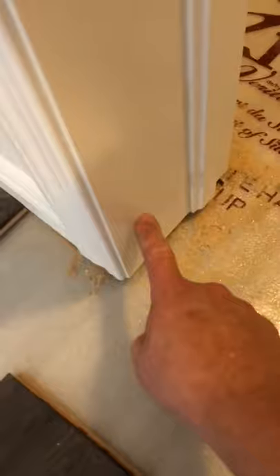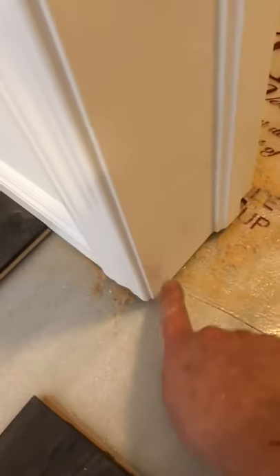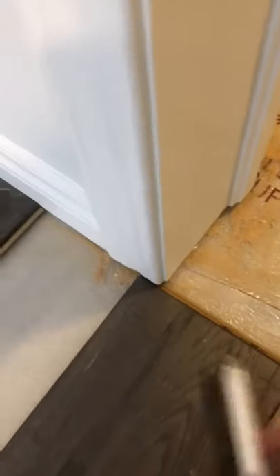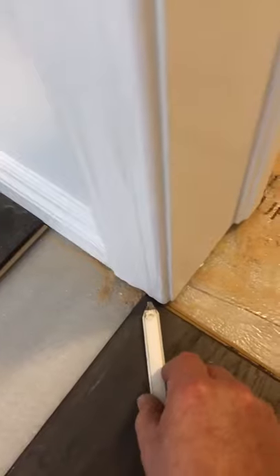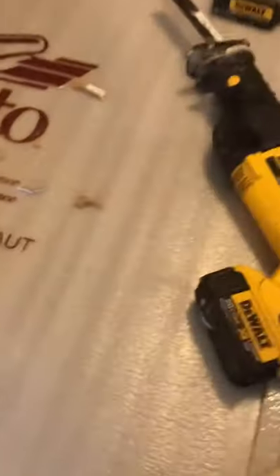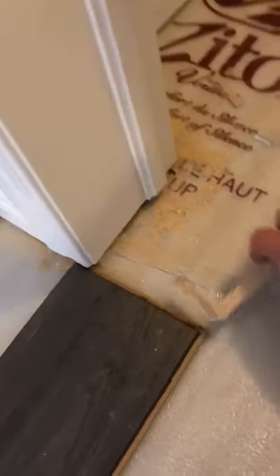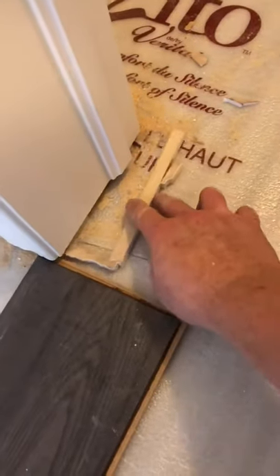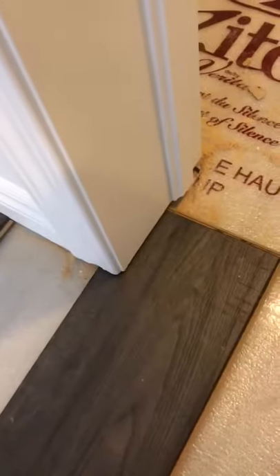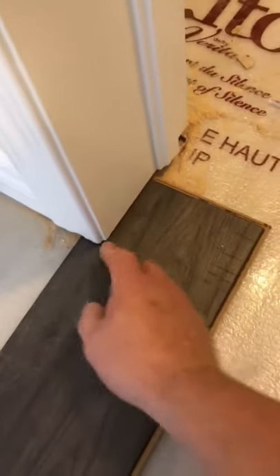When you get to a doorframe, with all these fancy angles and cuts, you'll never be able to do it nice and neat. The best way is to bring your trim floor piece over, put your pencil flat like this — it gives you just enough of a gap. Mark it all the way around. In this case I took the Sawzall and cut out the thickness needed off the entire jamb. You can use a handsaw as well, so that now you can mark it and it'll slide underneath and give you a nice finished look.